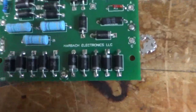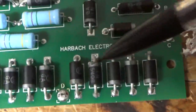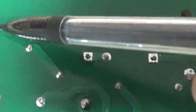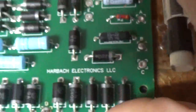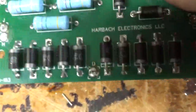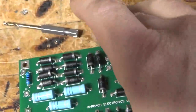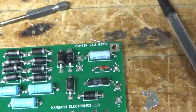Stay tuned. Remove the board — you can see the areas on this side lacking solder. There it is. And then on this side, right here, right here, and the corresponding spot. It's like that on both sides — it's not like there's solder on one side and none on the other side in the same spot, which would be okay. I'm going to reflow solder to every joint, both sides. It's a double-sided board — always make sure both sides have it.